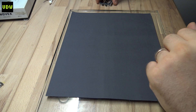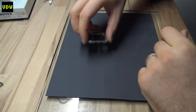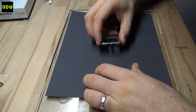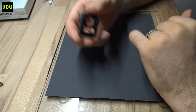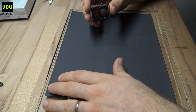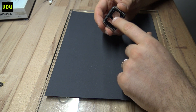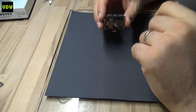As you've seen me do before — take the case, keep it as flush as possible, and do movements in all directions until you remove the visible scratches. Then increase the grit to around 1000, even 2000, or somewhere between 1000 and 2000. The idea is to get it as transparent as possible before going to the Cerium Oxide slurry for the final polish.